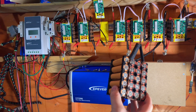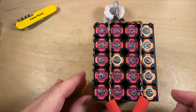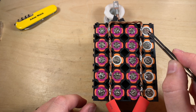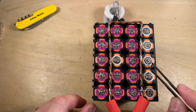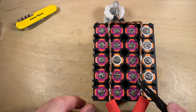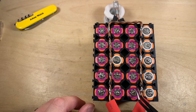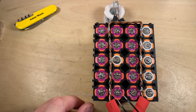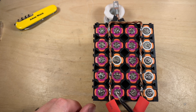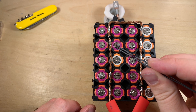Cell 5 is out. I'll check the positive side first - going through all my fuses and checking they're connected at both ends, both on the cell positive and on the copper bus bar. So far so good... but no, that one is not connected. And with this pack a cell down, that one's also not connected - these seem to have broken off rather than fused.